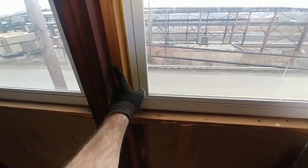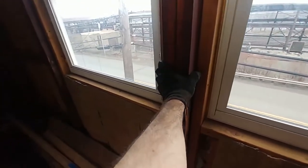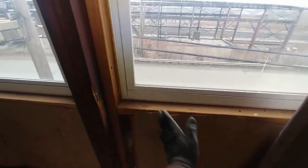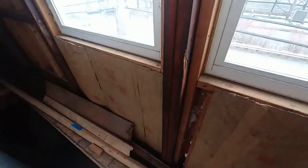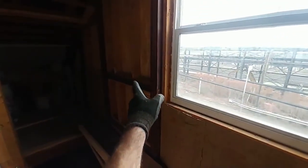And this, I'm sure, was framed 2x4. I would have done 2x6 so that you could just fly across the inside and finish it as well. And then this is the ultra cheap windows, you know, for cost effectiveness, but they have no jamb. So then you have to build a jamb, and in any case, you may as well build it. I don't know what the plan for finishing this is. You can just, you know, fur it out. It's hard to see because it's backlit right now.